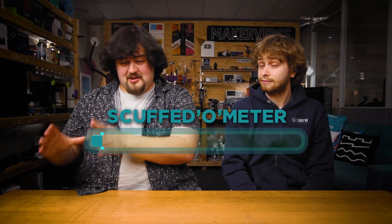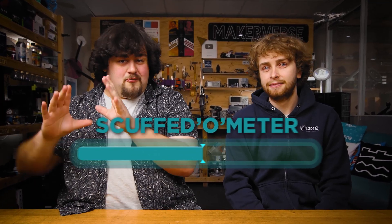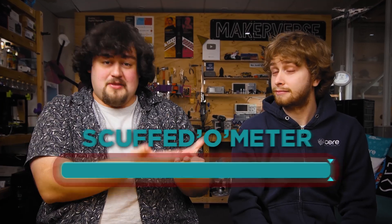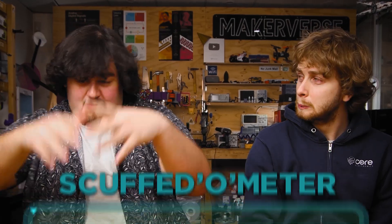So how about I get a Pico and dedicate that to the task of controlling the motors, because it's really good at doing that, and then I can just get the boards to work together. On top of that, I also needed to control some servos. Why not just get another Pico, make it control the servos, and connect it all together? When you know you have the ability to get all your boards working together, you have the design freedom to dedicate and divvy up tasks like this.